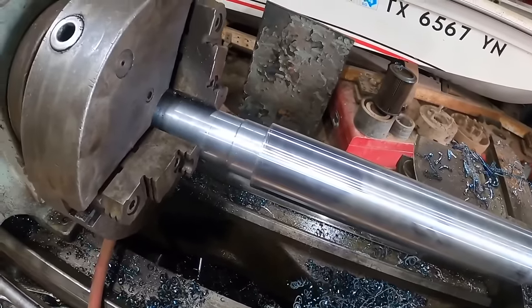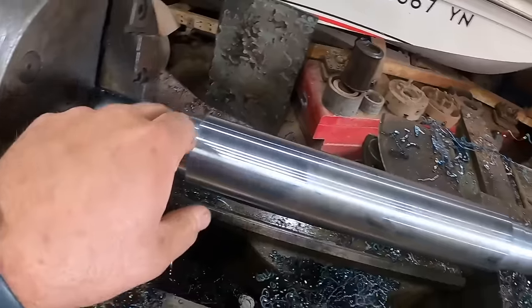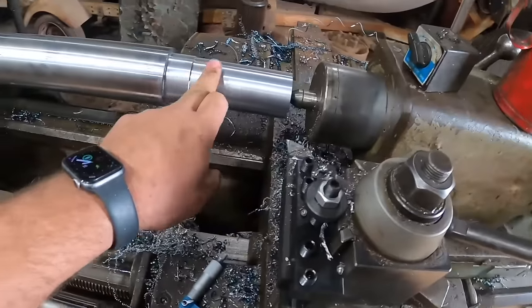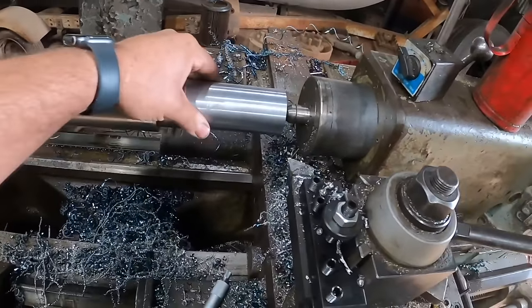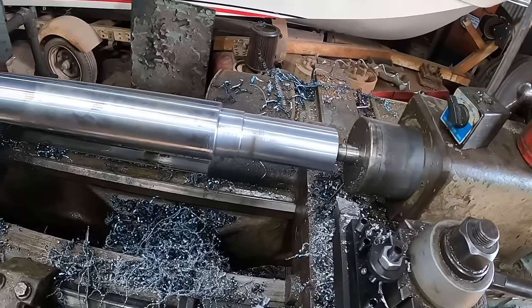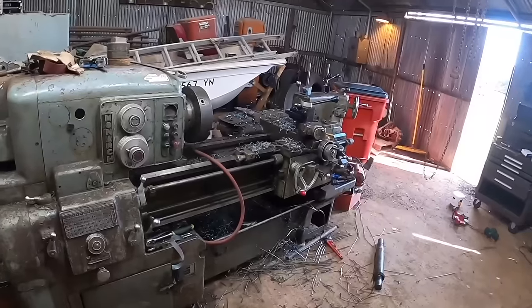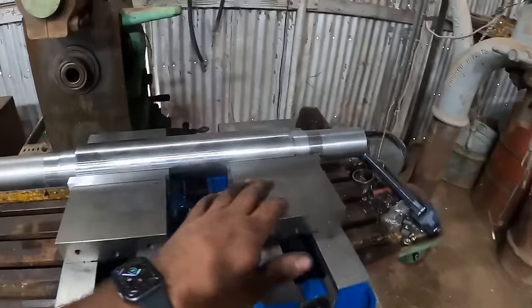So last operation on this lathe, that's one of the reasons I left these where the seal's going to ride a little bit big. We're going to take some emery cloth and sort of polish these, make them as smooth as we can before we get a seal riding on it, because if they're rough, they will leak a little bit, and I always assumed it probably would make the seal not last as long. So I got the shaft pulled out of the lathe and sitting over here on my horizontal mill